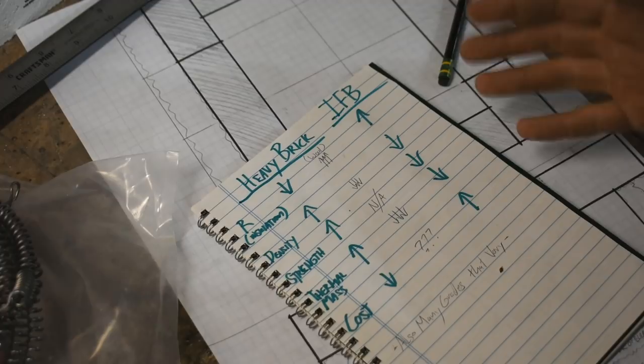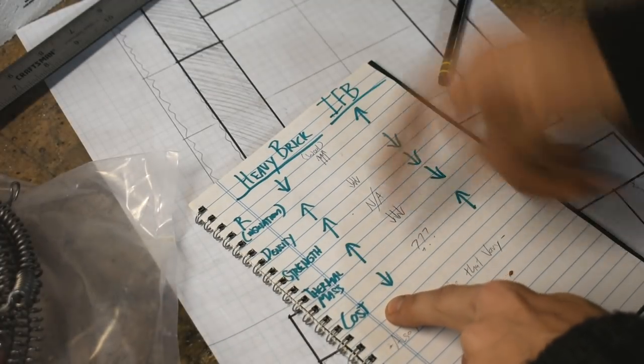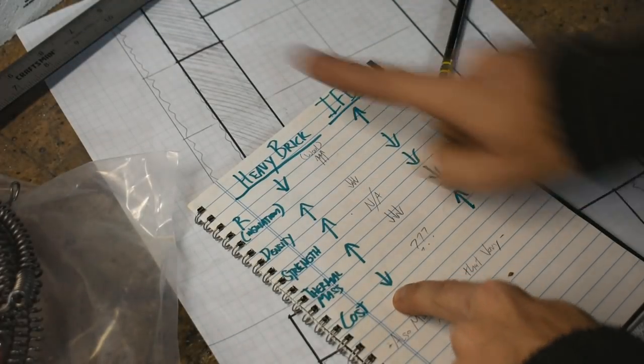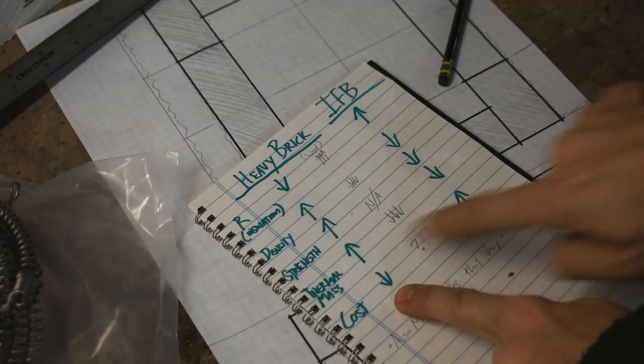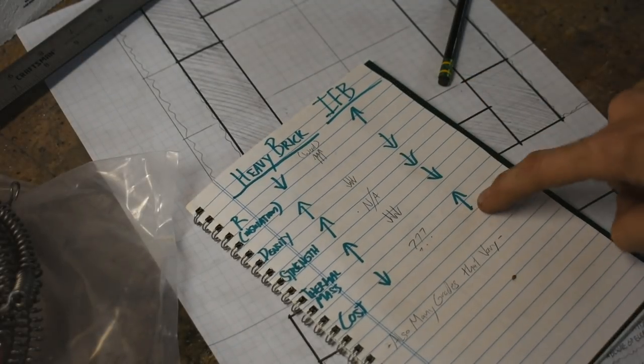In general, cheap heavy fire bricks are a lot of times rated for 3,000 degrees. A standard insulating fire brick is like 2,300. I paid extra to get 2,800. But you can get 3,000 degree insulating fire brick. You can get higher even. They tend to be very expensive.